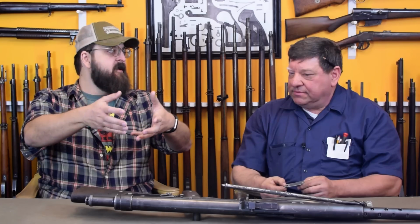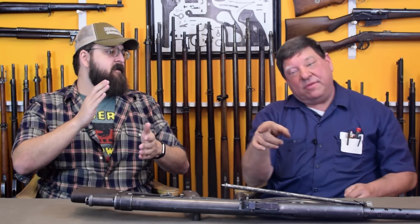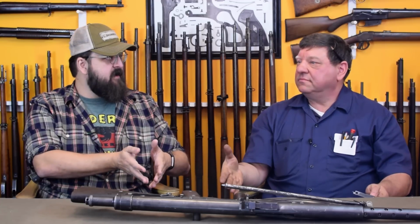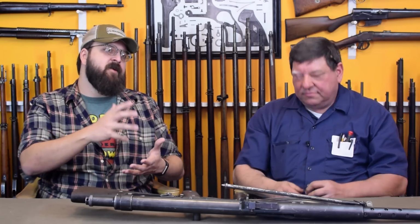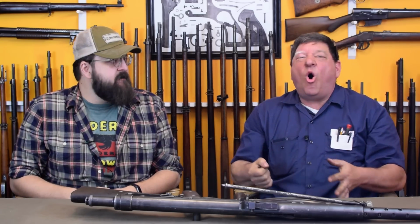basically end up in this weird 50-50 because you have a round body that's being struck by a linear tomahawk, and maybe it'll do that. Maybe it'll do that. If you get lucky, the gun shuts, the last round's sitting in the hopper, and you could technically reload another mag, but it'd be kind of wiggly. If it cuts the other way, it half feeds because it still doesn't get driven over. It still skitters, and it tries to cut the cartridge in half and jams up the whole thing.